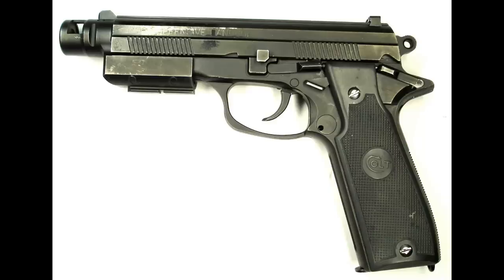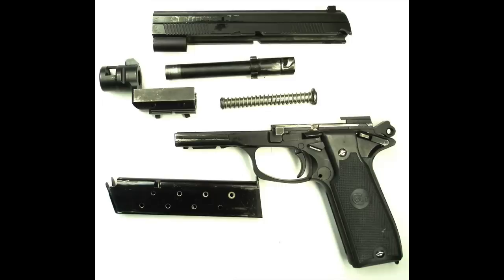At that same time Colt was submitting an entry for the Offensive Handgun Weapon System — what we now know as the Mark 23. They submitted a sort of hybrid Colt 1911, Double Eagle, and All-American 2000 that did utilize the rotating barrel. Unfortunately that was also a disaster: there were issues with frame cracking in the cam path, and the Offensive Handgun Weapon System was supposed to utilize a sound suppressor. You cannot attach a suppressor to a rotating barrel, so they came up with a mechanism that clamped onto the front rail — not nearly as effective as the suppressors HK had to offer.